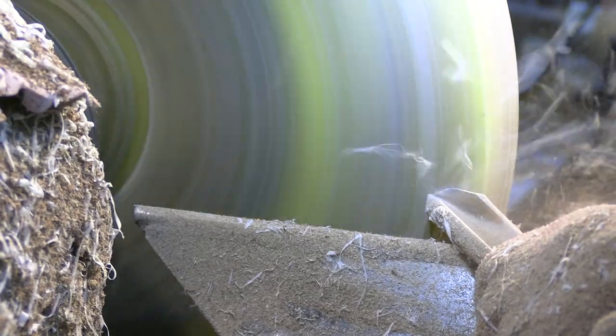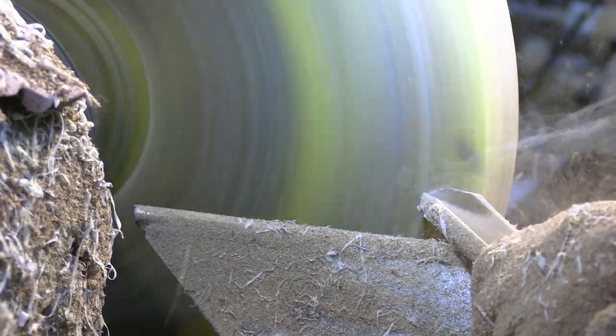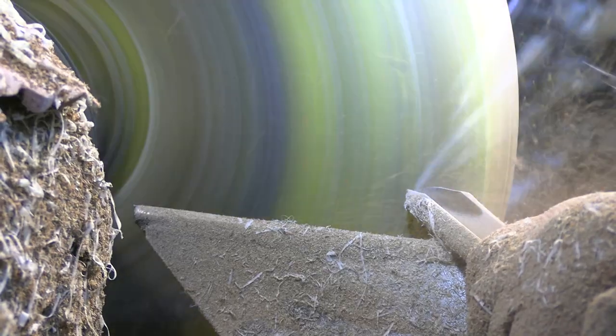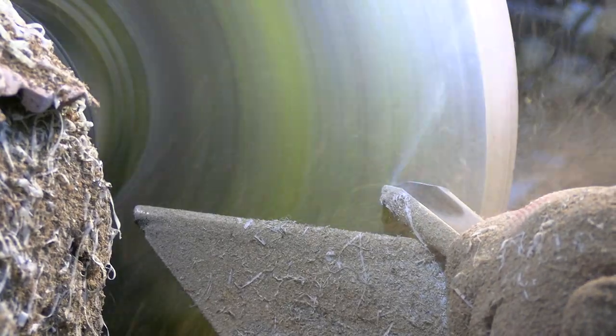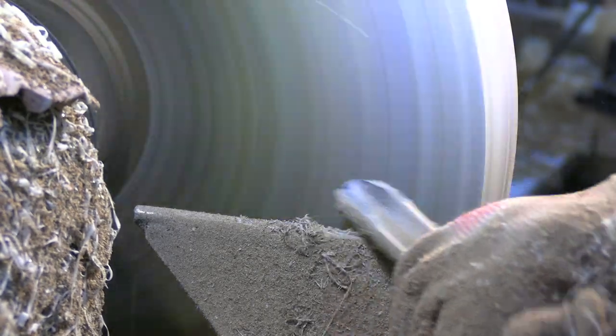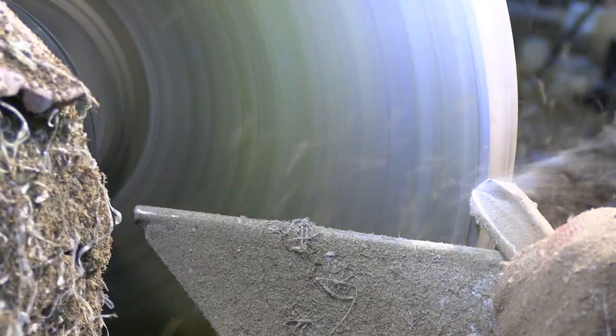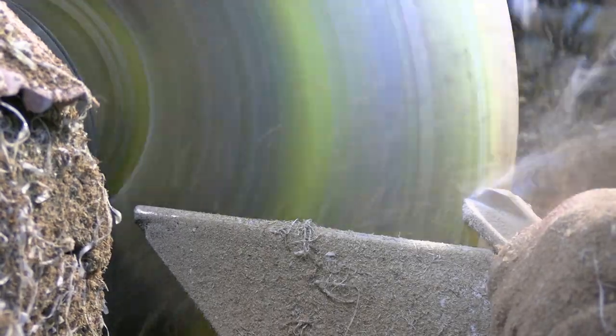I'm showing here that I've sharpened this gouge — I don't know how many passes I took before having to resharpen. That's one knock on high-speed steel over carbide. But the majority of the top of that casting was wood, so I figured the gouge would speed the process along. This is a real-time clip, and you can see the speed I'm going — you really can't push it any harder than this when you get down to the resin and wood combined together. I'm maybe taking a sixteenth of an inch there.